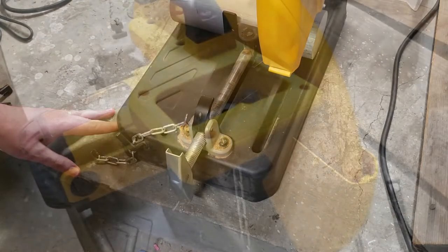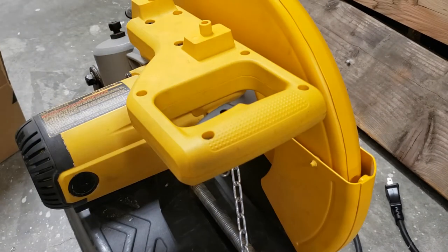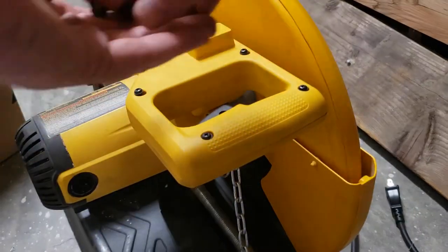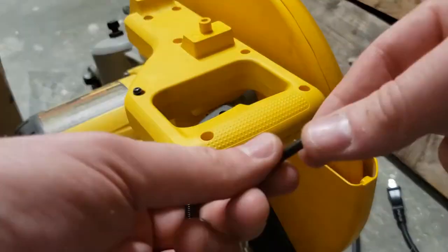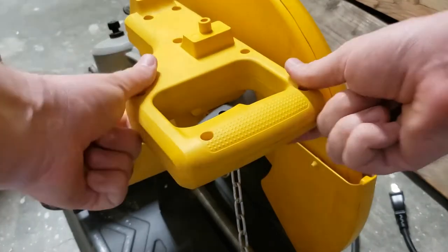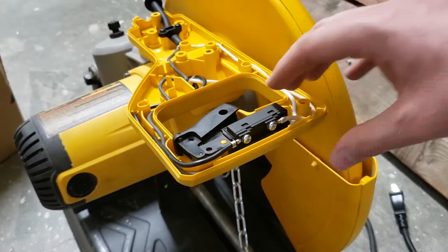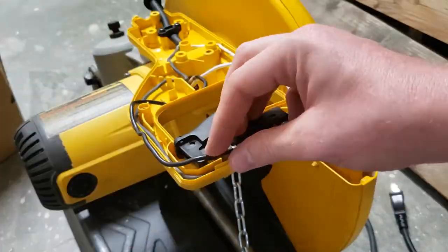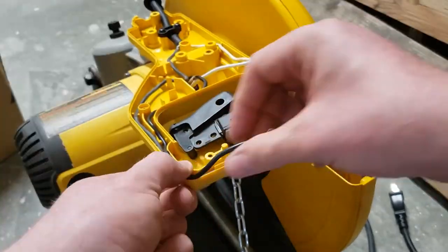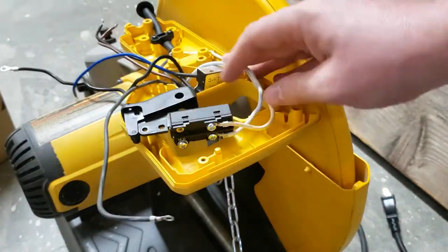Let's start our adventure with the Hitachi module. As this unit is designed to be hardwired as part of a table saw, we have to take the top of the chop saw apart to properly place it in the circuit. This could be good or bad. On the plus side, if the module is wired in permanently, the saw is just better with no extra external components to lose. On the other hand, you have to open the thing up and rewire it — bye-bye warranty and hello electrical safety concerns. We're also talking about adding a component known for generating a non-trivial amount of heat to a small wiring box, which is probably a terrible idea.